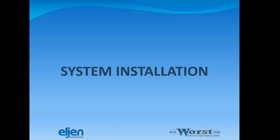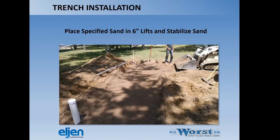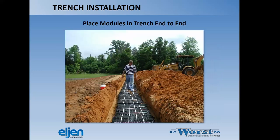System installation. So you're going to excavate the trench, place specified sand, and again, it's medium sand approved by the state of Idaho, in 6-inch lifts and stabilize it. So you're going to want to tamp it with the bucket or some kind of tamper to stabilize it, make sure it's not compacted, but it's laid in there even and consistent. You're going to do 2 lifts to get the 1 foot below the product. Place the modules in the trench end to end, like you see here.